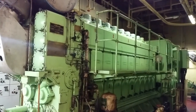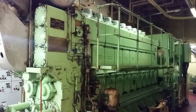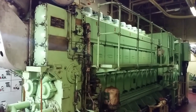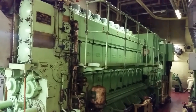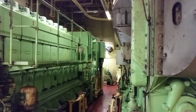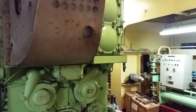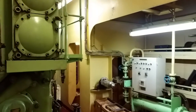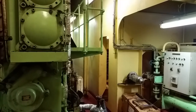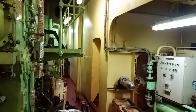The ship has four diesel generators - 2160 kilowatts, 2940 British horsepower. These are nine-cylinder engines. There are two on the port and two on the starboard side. Today we're working on generator number one, right here, which is all the way outboard on the port side of the ship. On the number nine cylinder we're going to have to remove the cylinder head and replace it.